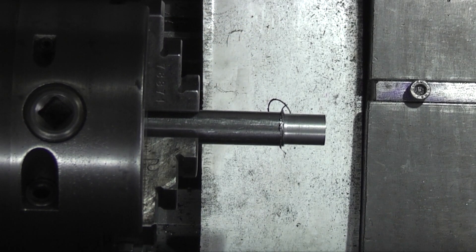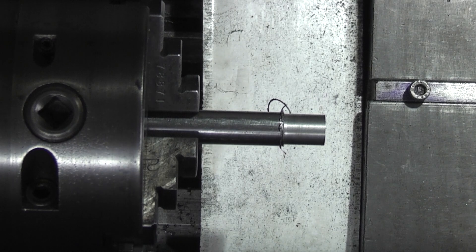What I want to do today is just have a look at the difference the tool will make — the type of tool you use when cutting to the finish you get. I had a comment saying that a lot of my turning the finish looks a bit rough, and that they can turn and get a nice shiny finish. Well that depends on a lot of things really: the speed, the material, the tool and the cut.